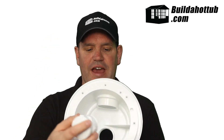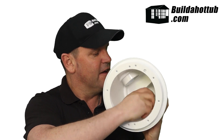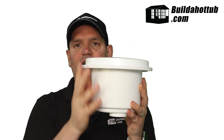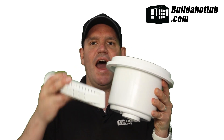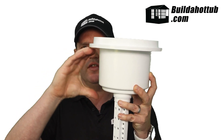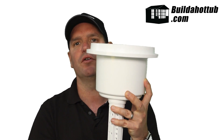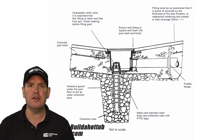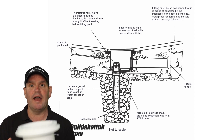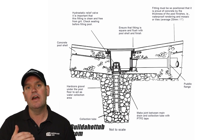The hydrostatic valve itself actually goes inside the lower drain. I can screw that into the base there. This then sits into your concrete base, and the bottom portion is actually going to have a water collector attached to it. If you look at the diagram behind me here, you can see exactly what I mean — we've got the actual valve, we've got the lower drain, and we've got the water collector, and you can see just how that sits in relation to the bottom of the pool.